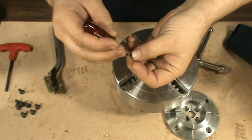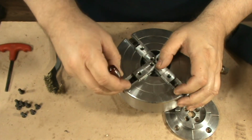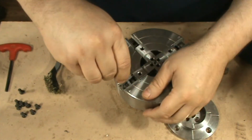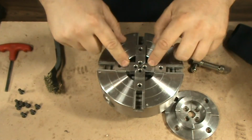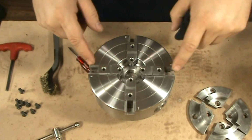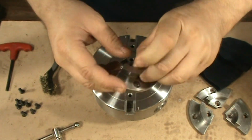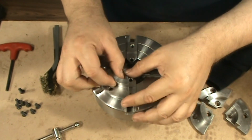Let's see if I can. It would be nicer to have smaller fingers for this. Okay, so now the stop is there, and the only thing that remains is to put back the jaws. What I did is I moved these sliders about midway open, and if you look, there is this tongue here that fits in this groove, so I slide it there